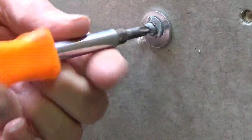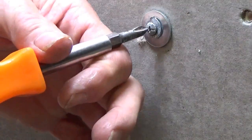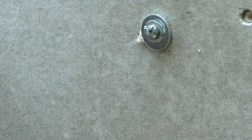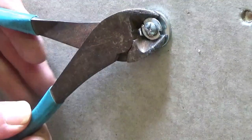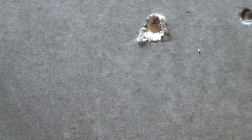Then just go ahead and tighten it up. But let's say you over-tighten it and it becomes unusable — you can still hang something on there, it just won't be as strong. So you know you're probably not going to be able to get it out that way. Let's just say this one was unusable now. So now we're going to go to a bigger one. We're going to use the same hole, but a bigger toggle.